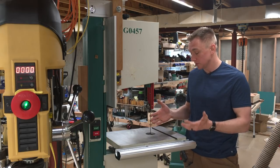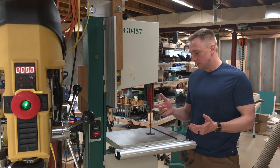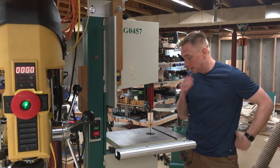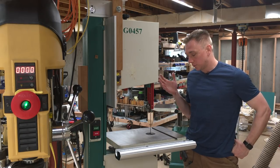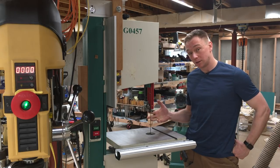Some people did comment about the blade itself — can we have a double-sided blade with resaw teeth on one side and curve-cutting teeth on the other? That doesn't really work because you need a back bearing guide, and with teeth on both sides you'd just be chewing it up. But that did get me thinking about the blade itself and how you can perform both resawing and curve cutting with one blade, and I think I've got a promising idea.